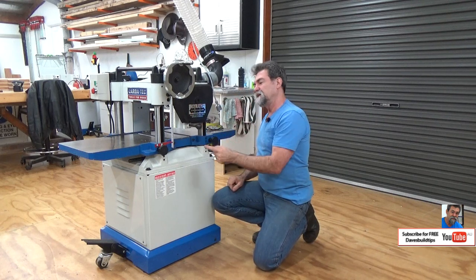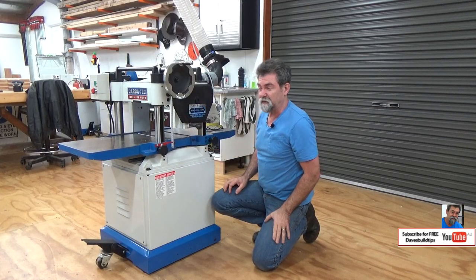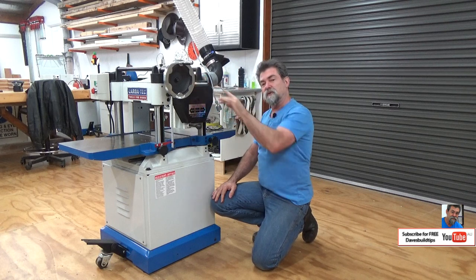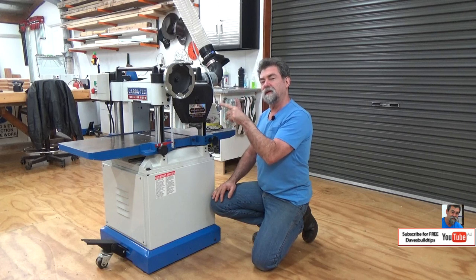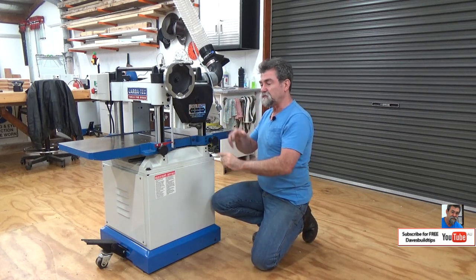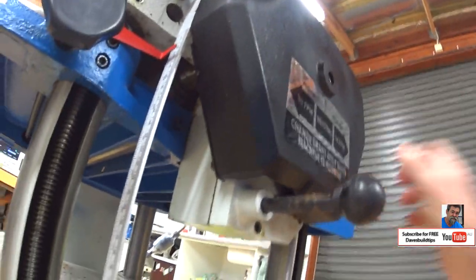A few people have asked about changing the oil in the gearbox. Don't be confused — the labeling isn't too good up there. This cover here is only the chain and sprocket assembly cover. And don't think that screw there is a drain plug for the gearbox — it's part of the housing clamping assembly. The actual gearbox is at the back here. Under here is the drain plug, and I'll show a photo of where that is. Up here — that's the filling point for the gearbox.